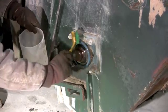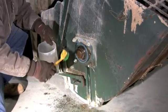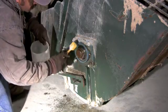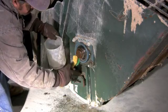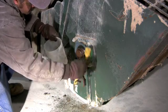The bearings on the monolithic mixer are sealed bearings. This means they are designed to keep out water and contaminants that come with mixing concrete. The main cause of a bearing blowout is over-greasing. A sealed bearing doesn't need to be greased very often — if you do the math, you don't have to grease it but once a month. A little shot of grease every couple of weeks is plenty.